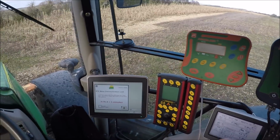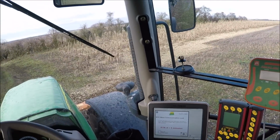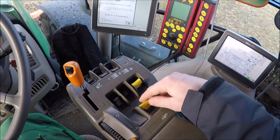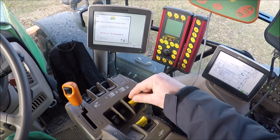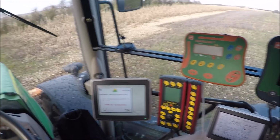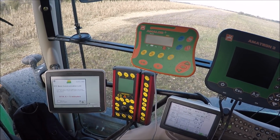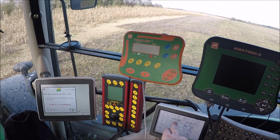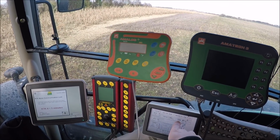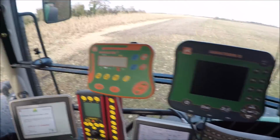Right, let's try that. Put hedge cutter, front topper. Hopefully you can see this. Did you see that? So we got hedge cutter PTO, front topper PTO. Alright, let's rev him up a bit, shall we? See what happens. Oh, that's spot on, look. We've got a 540 PTO on the hedge cutter and 1000 on the front. Or it says 1010, but it'll be fine.